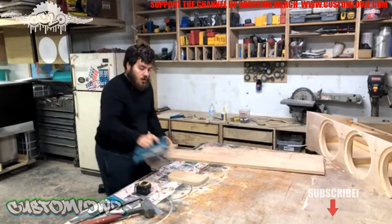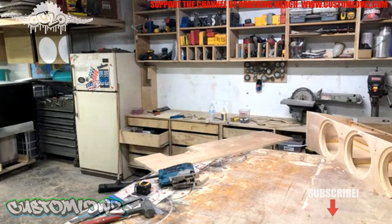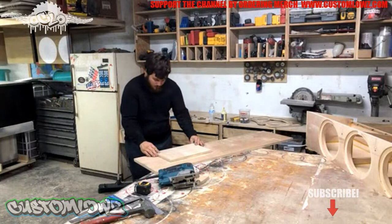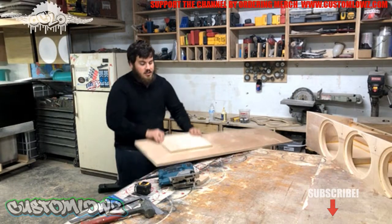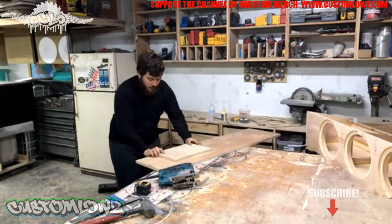There's one notch. Now I gotta find a piece of scrap wood over here that's about the same size. We wanted, you know, an inch or so overhang on each end. I think this piece should work good. Oh yeah, that'll work good. Okay. So basically, I'm stacking a piece of scrap wood on top of it. You can see here. And then I'm going to brad nail that on there.